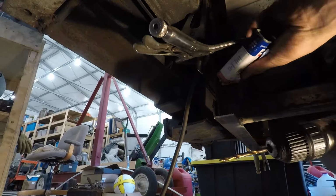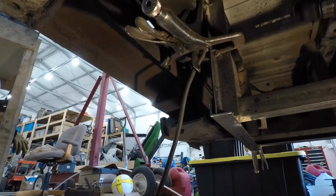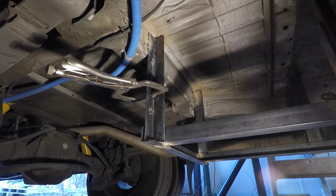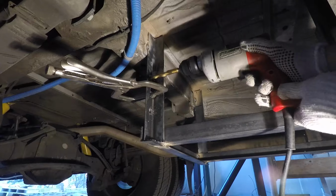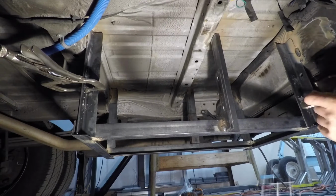The bolts, nuts, and washers that I am using are all grade 8 zinc coated, half-inch in size. They are very strong and will resist corrosion, which is why I'm going with them. And in order to get the holes drilled, I am drilling a little pilot hole and going through 2 vertical supports at a time as they are clamped together.